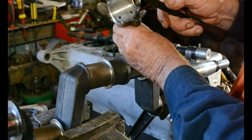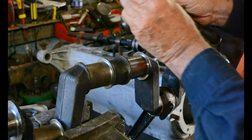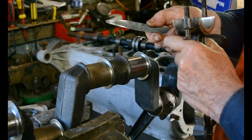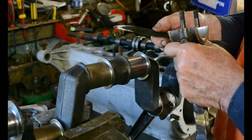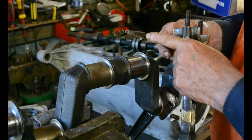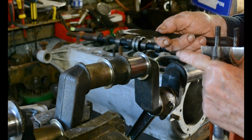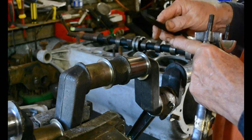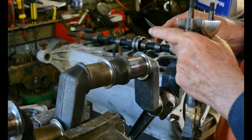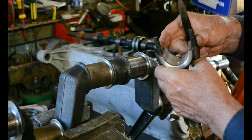There it is there. I've had this one for years. You can make one up out of a half-round file, or you can purchase them — there's quite a few at car boot sales and around the district. Now it's hollow ground, that is, it's ground on the face of the grinding wheel, and then it's a matter of just honing it up nicely. This is very sharp and it will cut that white metal very easily.